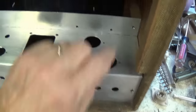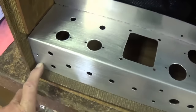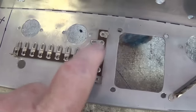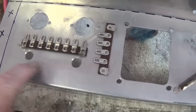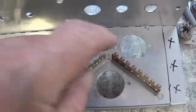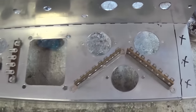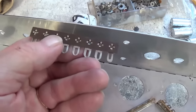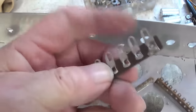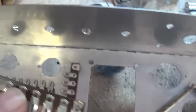I'm going to rivet in terminal strips near my tubes and jacks and other components so that I'll have places to make connections for each of the tubes to the rest of the circuit. The terminal strips will stabilize those connections. I'll also put one here horizontally right below where the tremolo circuit is, to give myself plenty of lugs to support the tremolo circuit.